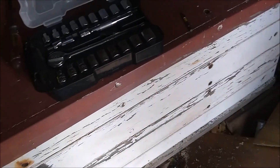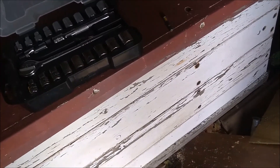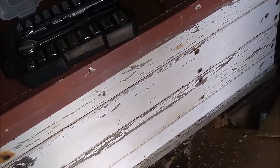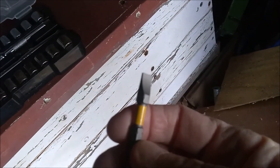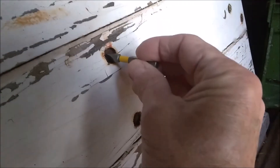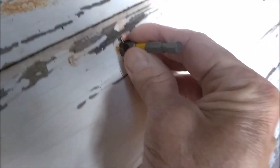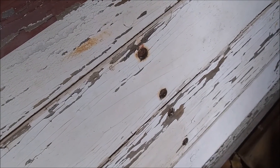We're back out in the shed with Clarissa. I did some research on YouTube and realized I was kind of being hasty and foolish about not taking these screws out properly. With the research, I found out that if you use something to impact the screw, you literally put the screwdriver bit in the slot like this, and then you hammer on the back of it. What you're doing is breaking loose the way the screw is sitting in the hole by hammering it.